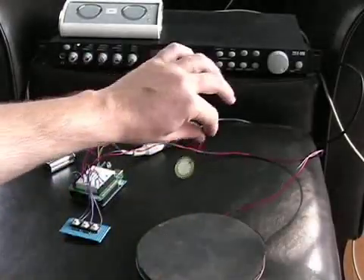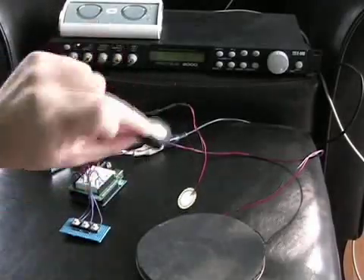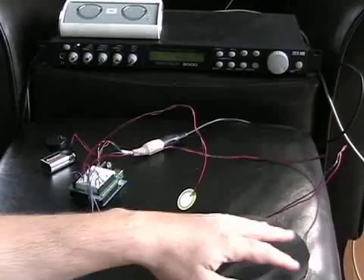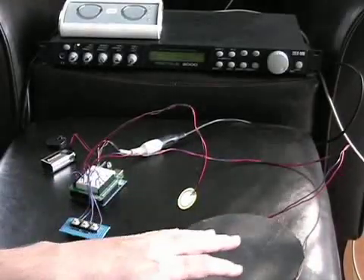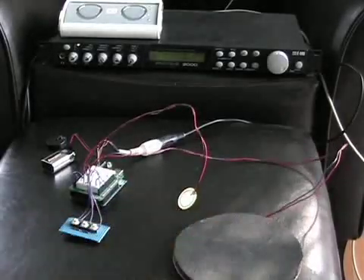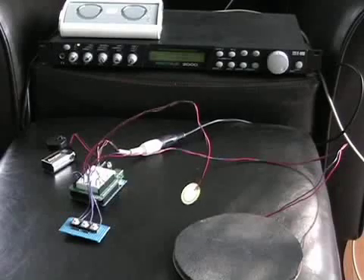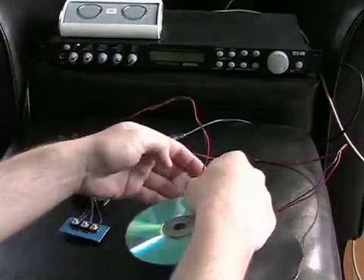So what is this? Well, these are piezo buzzer elements. That particular one was freed from a Radio Shack piezo, about two bucks. This is the same thing but it's been bonded to a brass plate and then has an old mouse pad attached to it to absorb the shock. These work pretty good as drum triggers and they are velocity sensitive, so the harder you hit them the louder the sound is. And this free piezo is nice but it's a little bit out of control, so let's make a quick little impromptu drum surface for it.